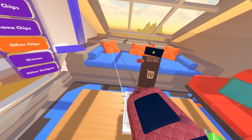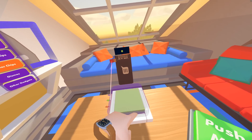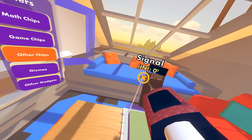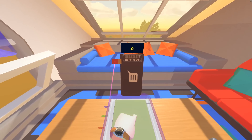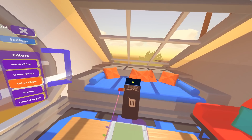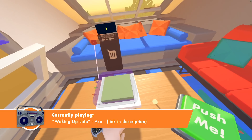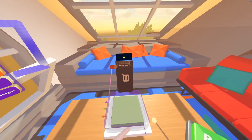If we disconnect it and reconnect the green pin — 'total currently in the zone' — it says zero because there's nothing in the zone. Stick my hand in, it stays as a one; pull my hand out, it goes to zero. And lastly, when exiting the zone: if we had wired that up, nothing happens until I actually leave the zone. Once I leave, we get a value that outputs. So we can use these to drive and trigger events for this button — hand goes in, button goes down; hand leaves, button comes up.